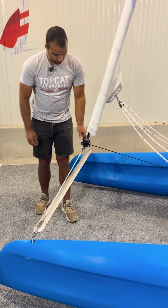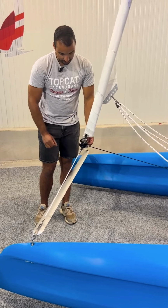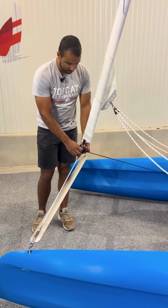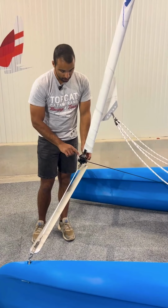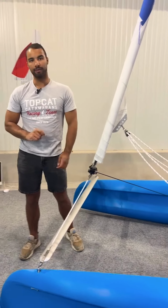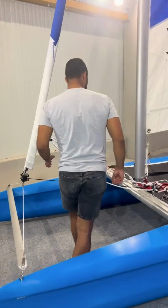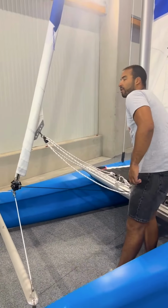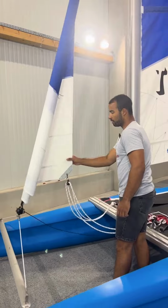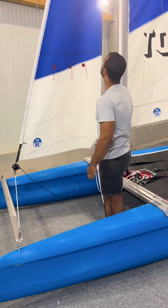Here it's always important to see, does it roll? Yes, it does. Should something snag in the jib roller, you can spray a little bit of Teflon spray into the bearing. Just a little squirt of Teflon spray, then everything works perfectly fine once again, just like it should. Let's roll out the jib first. Let's carefully see if it rolls out well and smoothly. That looks great. Our jib looks fine too.